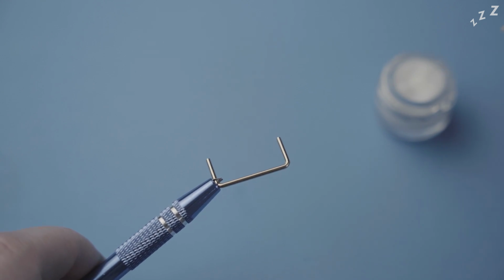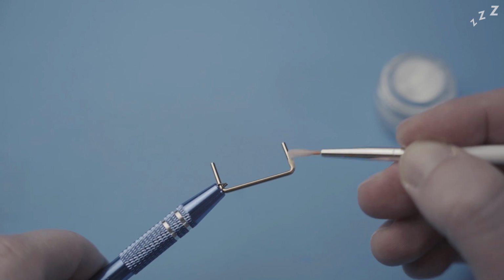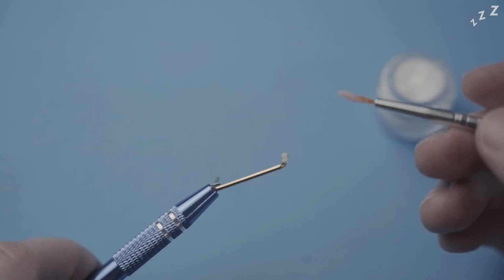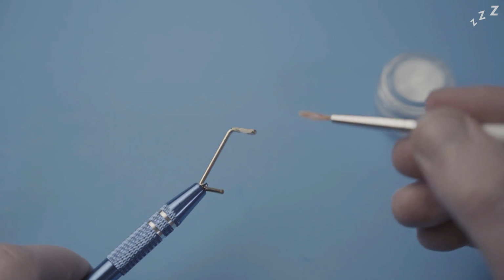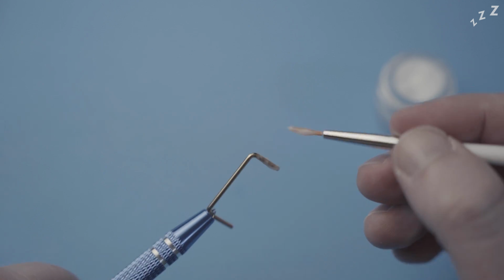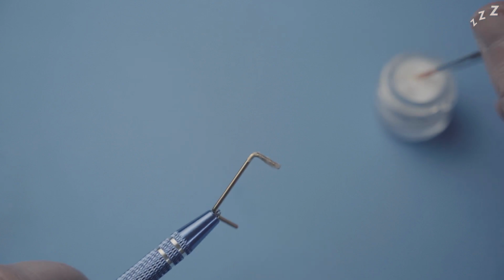And then go ahead and grab that paintbrush once more. And for the wires specifically, we can be a little bit more generous than we were with the stabilizer housings, but the same technique is still going to apply. You're just going to want to dab the lubricant onto the wires. So something like that, just work the coat evenly. That is going to be a theme across stabilizer lubrication.